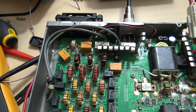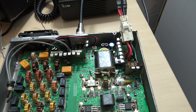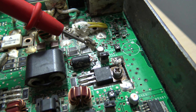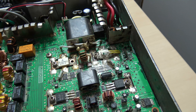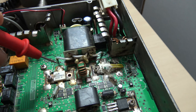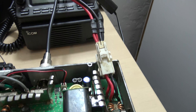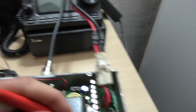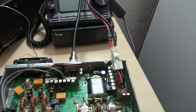I had my meter going and was testing for voltages per the service manual for bias and all that. You may have already spotted that resistor — this is a bias resistor, which is pretty black. I smoked that by accident after going through all this; I tried a couple other things and saw the smoke come off of it. But regardless, I started testing the voltages at the collector, base, emitter and all that, making sure I had the appropriate voltages, and also testing for current drain.